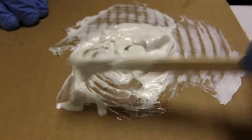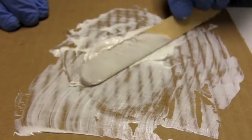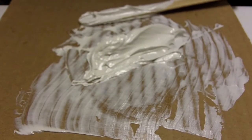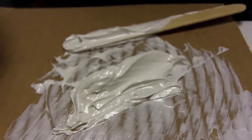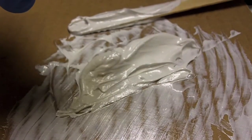Very often people will use pigments designed for paints, which are water-based. They're easy to clean but not very good for the glue itself. The polyester-based pigment doesn't dilute or weaken the strength of the bond. Again, you're adding hardener at about 2%.